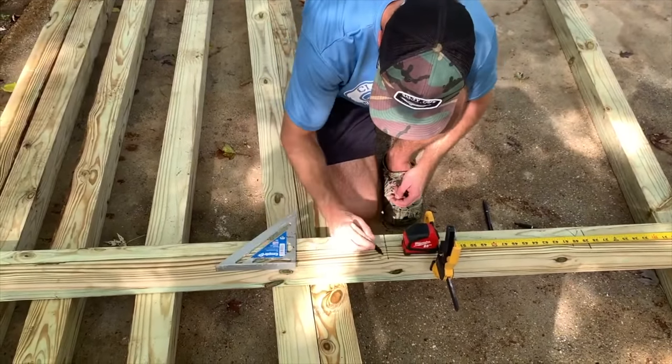With the construction adhesive in place, it's time to take our panel and push it up against the half inch overhang while also embedding the panel in the construction adhesive to give us a nice clean installation. After cleaning up any of the excess construction adhesive, simply give it a few hours to dry.